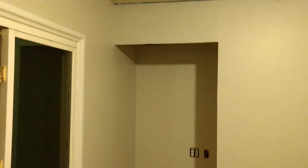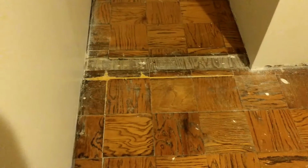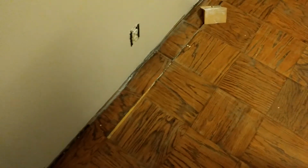Stuff on the floor. And we've got this closet. I need to get the door into here, and I need to deal with this flooring. We're gonna bust out the little pieces of floor tile, and I'll cut up some new pieces that'll fit in there as whole pieces so that the closet is continuous. And then there's some spots here. The people who owned the house before us had filled the stuff with some kind of plastic goop before they put carpet down. So we've got to dig that out and put some stainable filler in.